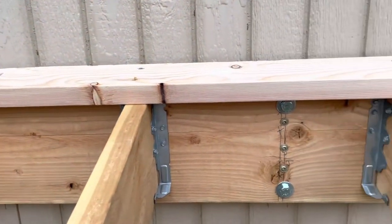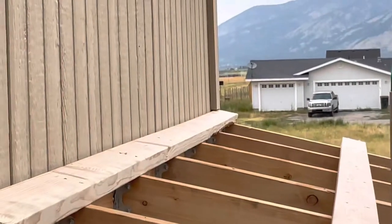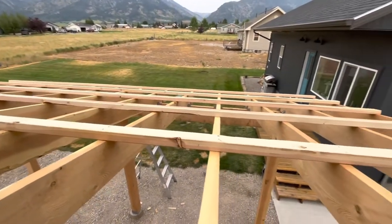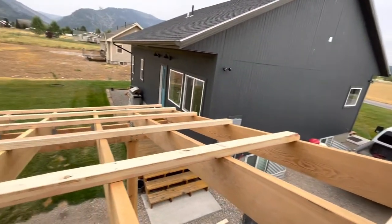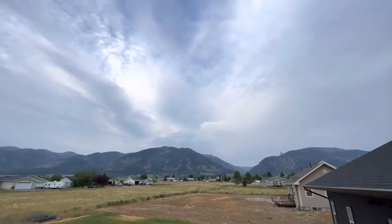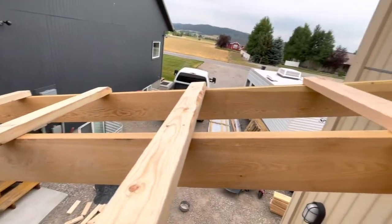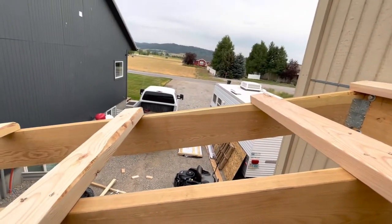Aerial view of the purlins - they're all on. I had to get the Sawzall and notch out the one area over there, but I think everything's good. It's laid out pretty nice, I did them every two feet. It's a pretty evening sky here in Star Valley. Got a little tricky doing the last part by myself - got to throw a few nails in the edge and then we're ready for metal, which was delivered today down there next to the truck.